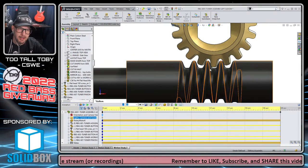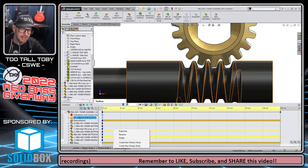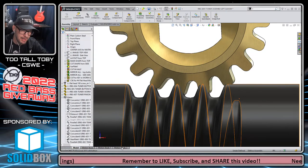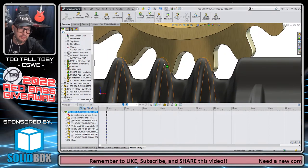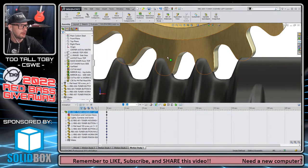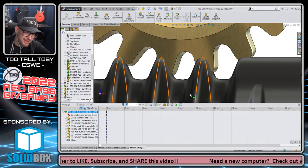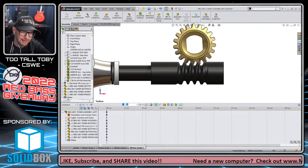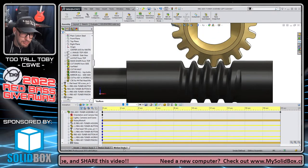So, if I'm looking at this and I'm like, this isn't what I wanted it to be, interfering, the best thing I could do would be to go back to my model tab, right mouse button here and say create a new motion study, and then look at this motion study. It starts out with that interference the way that we want it. I know we don't really want that, but it's a good little pro tip to know about. So I'm going to delete that new motion study that I created.